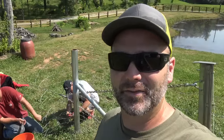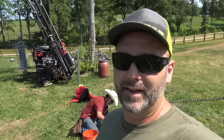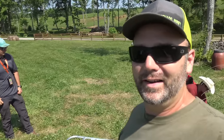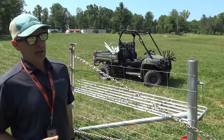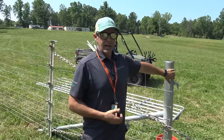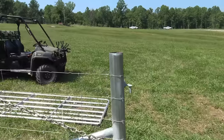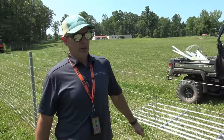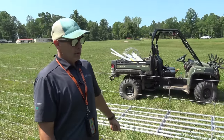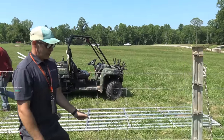That's why we're having the fence expo here on the farm — for education, for everybody. I really want to thank Luke, Farm Fence Solutions, and Tornado Wire for jumping in and helping out. Sebring's finished tying off the 1348-12. Now we're going to slack the winch cable — what we're shooting for is less than a half an inch of movement in our strainer assembly when we load the pressure back into it. We've got zero movement there, well within our limit. Once we've let the pressure off with the winch cable, it's time to take the strainer board out. We over-tensioned by just an inch or so, which allowed the slack between the strainer board and the knots to take up, and we've still got a very tight fence.